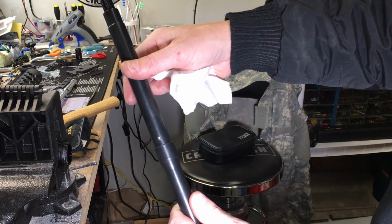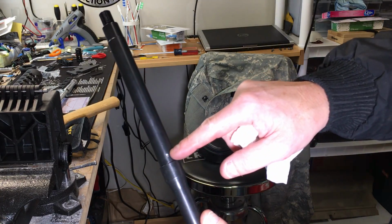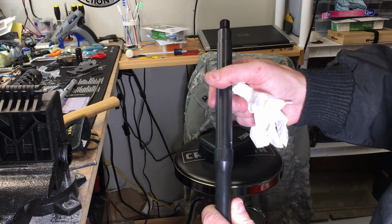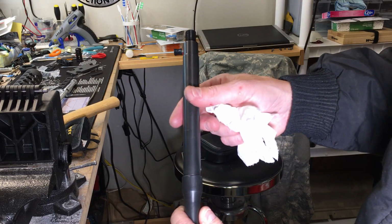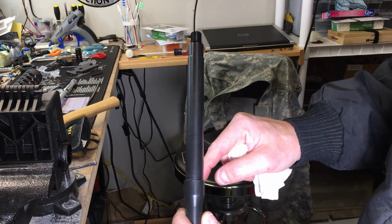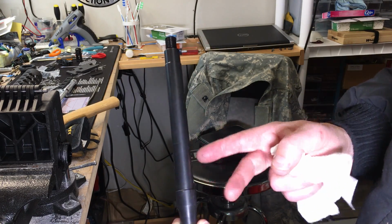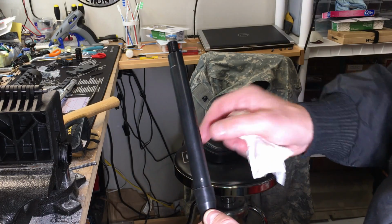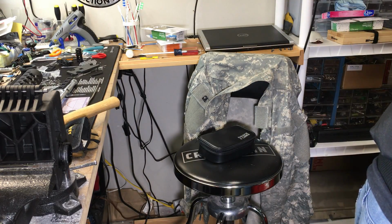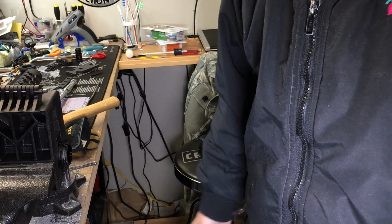Going back to what I mentioned about the gas block, you can see that they made one single dimple there, so the bolt from the gas block would sink down into the dimple. Great attention to detail. You don't see a lot of people doing that if they use those types of gas blocks. Some companies that use low-profile gas blocks will cross-pin them, so they'll have a jig that they put on here, and then they drill partially through the barrel. So when they drop the gas block on, they hammer in a single pin, or they'll do a single pin and 2 screws. This one just happens to have the 2 screws. So everything I've seen so far about the build is good with this. Now I'm just going to clean this up and remove whatever's on here and put some new grease on.